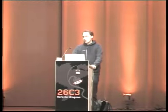And one important thing here is that even though we read the data into the shift registers in a serial way, the update is always atomic. So you shift in the data, and all the bits change while shifting, but they won't become effective until you enter the update state, which is next to the scan state. So they become effective only after you leave the scan state. So you have an atomic update and atomic capture for all of the scan chains, and you don't need to worry about shifting in stuff too slowly.